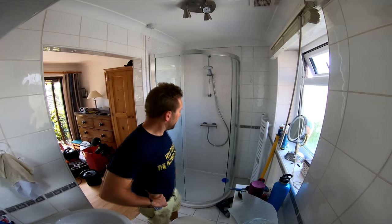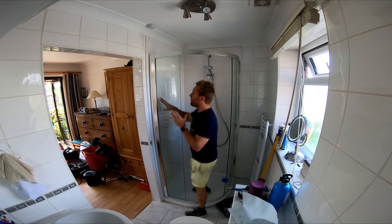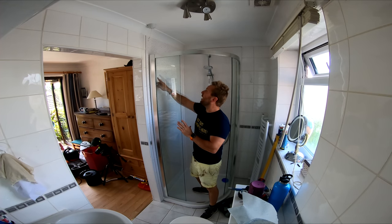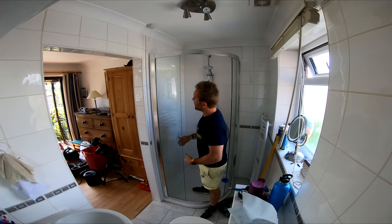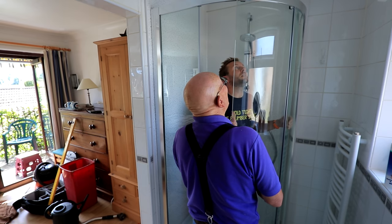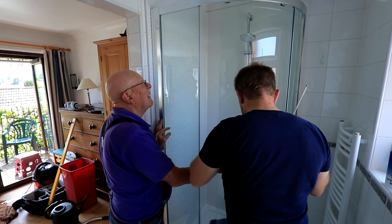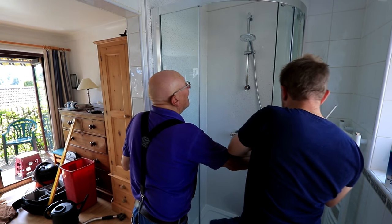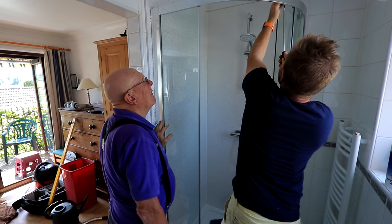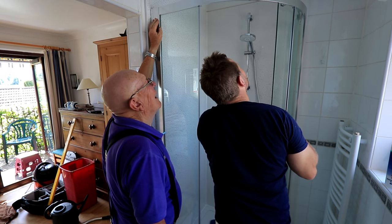The only fixed point is that other profile on the right-hand side. Now we've got everything lined up and looking good, all we need to do is mark the holes down on the other profile, drill them in, and fix our shower screen to the two profiles at each side — and then it's done. For the door, you should always attach the rollers away from where you're going to hang it, then bring your door in, hang it on the top bar, push your spring-loaded rollers into the bottom bar, and adjust so it closes and opens nicely. This can take a good half an hour, and you want to let it settle as well.